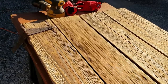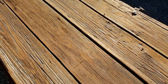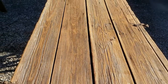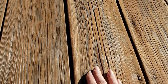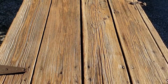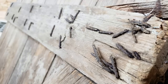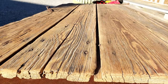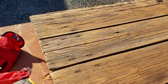That was just one sweep with a 60-grit, just to get some of the big stuff off. I really like it. It's still very rough and has a lot of splinters, but it got rid of some of the big stuff. You can still see a little bit of that gray wherever it's going to be real deep. Now, you may say, why don't you take them off and run them through the planer? Well, if I take them off, first I'd take all those nails out that are all bent over, and then it's not going to be original. And secondly, there are nails in there that I'm not even going to be able to see until I get in there with the planer, and then it's too late. So I'm leaving them on. But I am liking it already, Curtis.